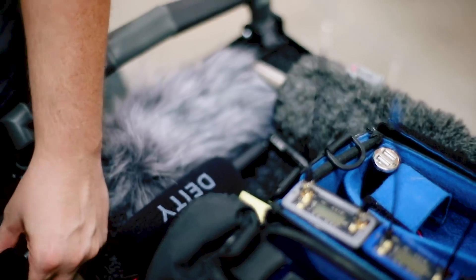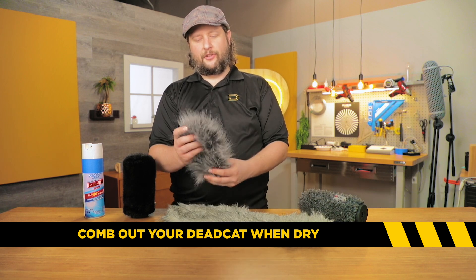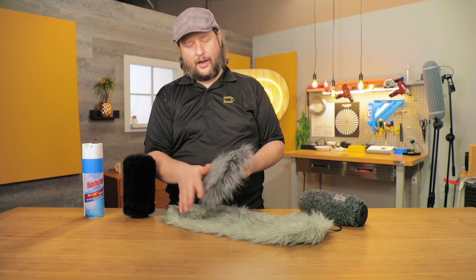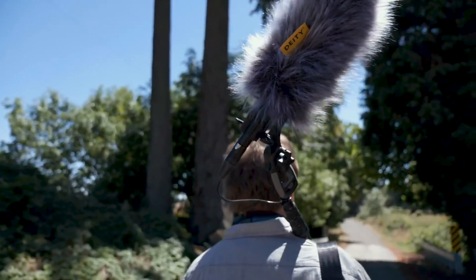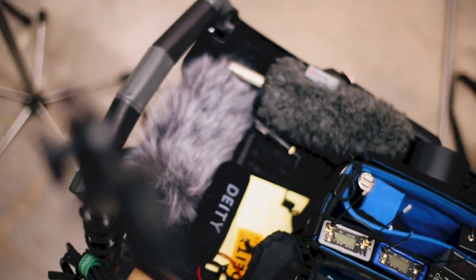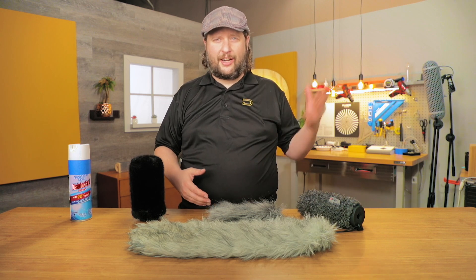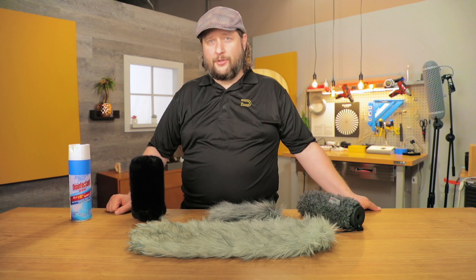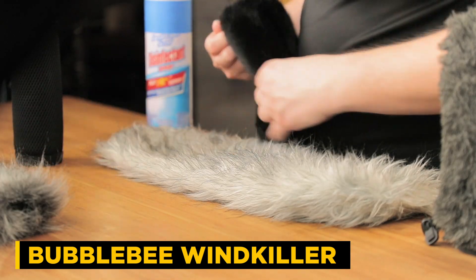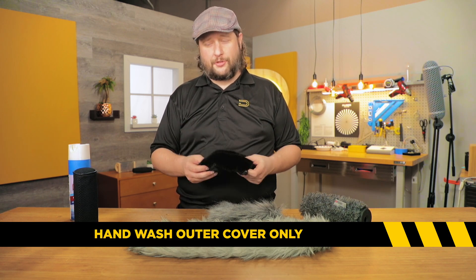Now, when you have one of these and it is now completely dry, what you can do is comb it all out. Because you're going to want not something that looks like just a giant kind of mess — with messy hair, you're going to actually want to comb all that out. Those tangles can actually cause things to clump up, and something like that can actually affect your sound pickup pattern, because it's acting like a giant shield for sound to not get through. So you may end up with a cloud of sorts in your pickup pattern, and your microphone may not be able to reject things coming left and right as evenly as before if the hair was actually straightened and combed out. Now, if you do have a Bubblebee kind of wind jammer — this little guy has to come out when you clean it up. You're actually going to wash this thing with just the warm water and some soap, and just hit it with some disinfectant spray.